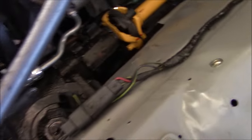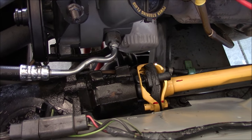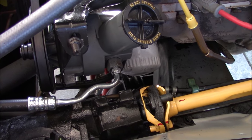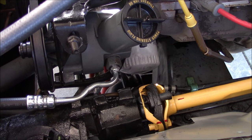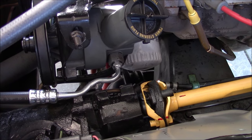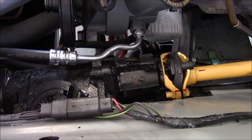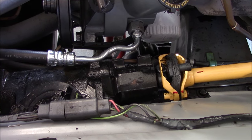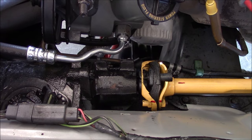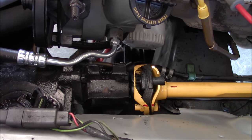So I got to pull the steering box. Put a new power steering hose on - we blew the hose. I disassembled the pump because I had to drive like 30 miles with no fluid. I kept stopping and adding more fluid. Actually the pump looked like it was okay, but I don't trust that I got it back together right, so I'm actually going to replace the pump. But something's wrong with the steering box. I've only got power steering in the right hand direction and Armstrong steering in the left hand direction. So it's coming out.